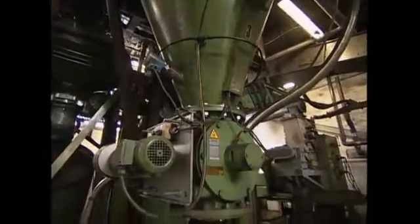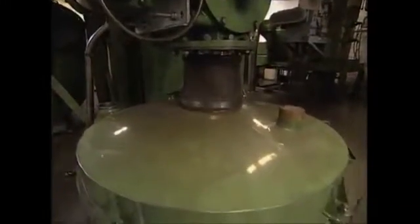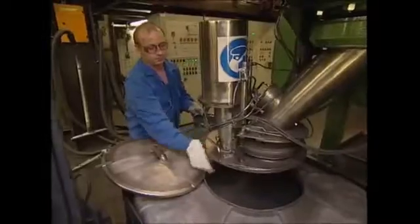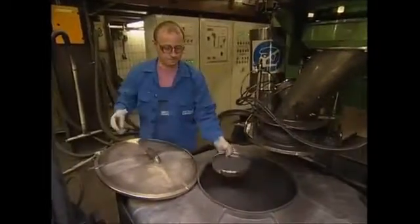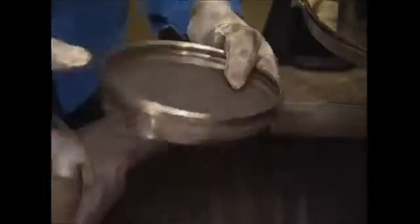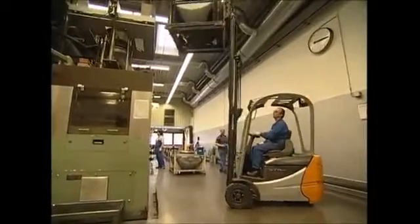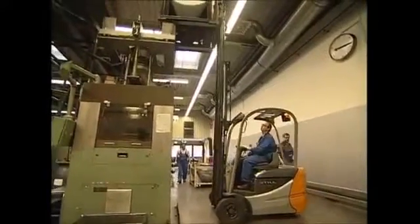You might be familiar with graphite as it's used to make pencils. The positively charged mixture works by absorbing electrons that pass into it. It gets pressed into rings which are then inserted into each battery case. The more that can be put into each battery, the longer that battery will last. The mixture is loaded into the top of the machine, and once it's compressed, the rings are loaded into each battery as it passes below.